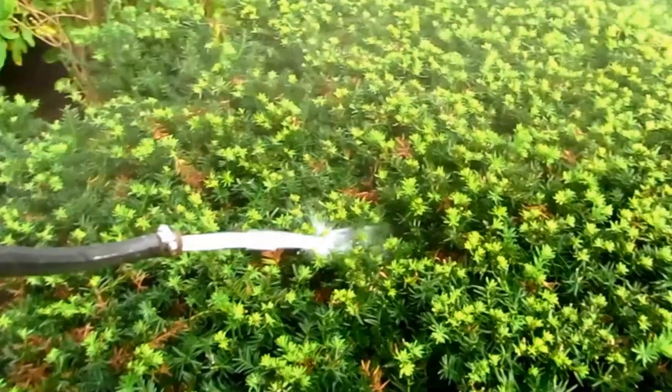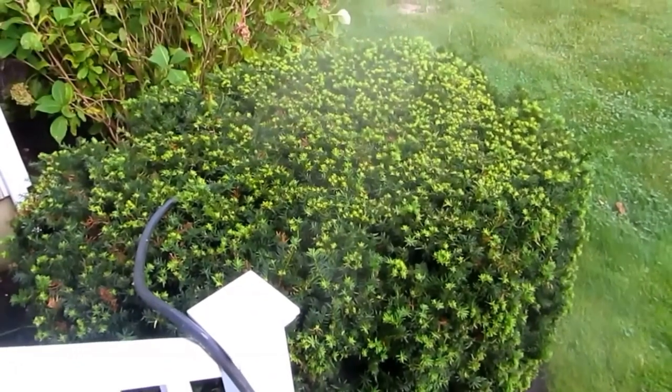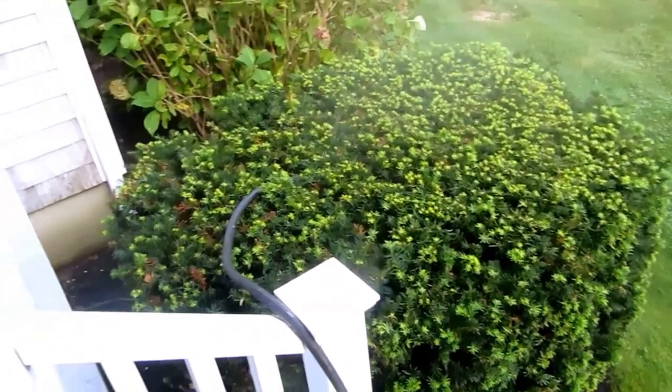The reason why I have to go through the hot side — you see this cold side I got off, you come down alongside the water heater. There's a T down at the bottom before it goes into the drain. So if I went into the cold, it would just blow air right out the hose and it wouldn't blow the water out of the tank. So doing it this way, I'm bringing air pressure into the hot side at the top of the tank, and it's blowing it out the hose. This is kind of a rare setup but this is the way this one is.